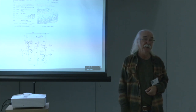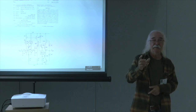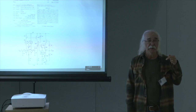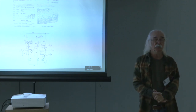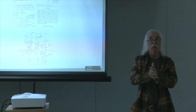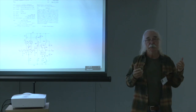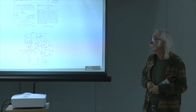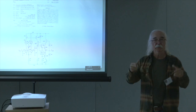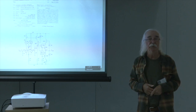Now, that's the ideal case. But one of the reasons that triodes are so beloved, at least by me, is you can play that game. You can adjust the parameters of loading and bias, and you can generate positive phase second harmonic. You can go the other way into what we think of as the middle zone and null those out. And you can go further, and now you've got a negative phase second harmonic. You can play with them, and it's lovely stuff. That's what was going on here. We were simply playing with the relative levels of voltage and current to the devices and trying to, as much as possible, null the distortion altogether.